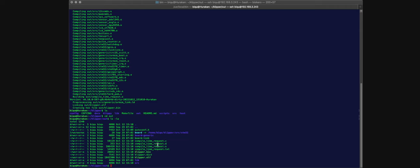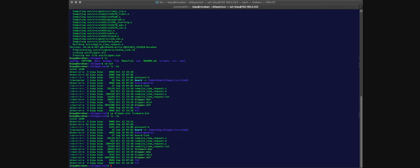So now you cannot install this one directly on the Manta board. Basically, what you need to do, they say, is rename this. I will keep the original and rename it firmware.bin. So I'm making a copy. Okay, let me check one second here. I'm going to correct it, firmware.bin. Let's see if it's there.